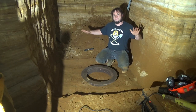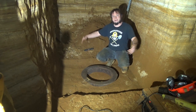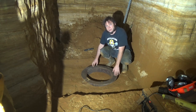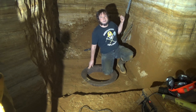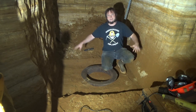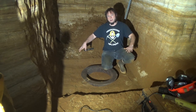Now this square is going to be filled with cement. Our manhole collar is going to sit right in the middle here. The cement is going to flow underneath it and support it because it's got this little overhang lip. We're also going to throw some rebar and scrap metal down in the square to reinforce it, and then once the cement hardens this square will be our manhole floor.